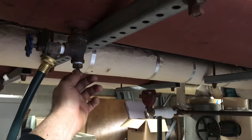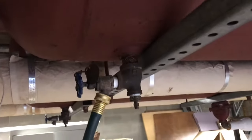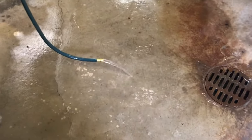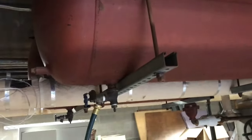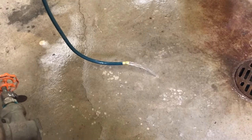So now this is drawing in air. I'm going to let this go for a little bit because this one seems to be filling up with water. I did this last in September and right now it's March. They're big tanks on a boiler that's about 2.5 million BTUs. We're just going to let this drain down quite a bit because they do hot water for the building also. I'll be doing this again in the fall — it's always good while you're on a boiler maintenance to make sure you take care of everything.